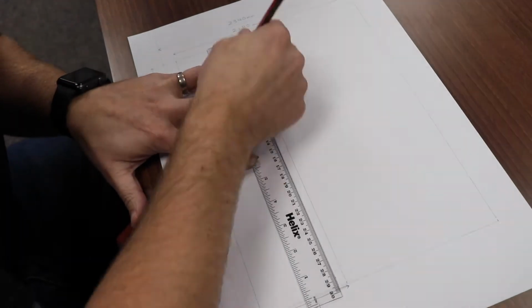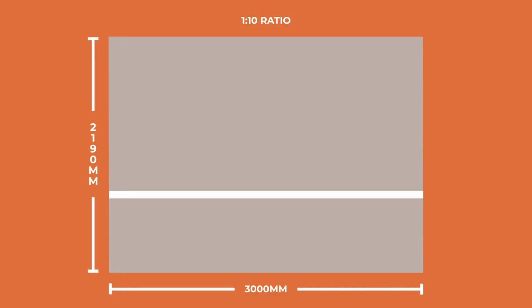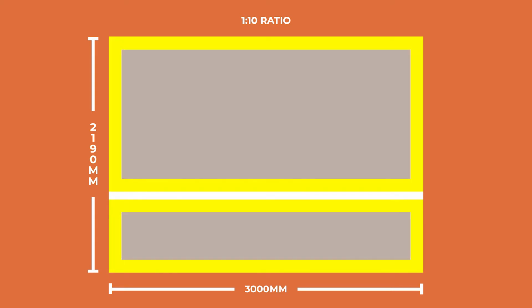Now that we've drawn our dado rail, we can start to draw our panels. We want the areas around our panels to be completely equal and parallel. We've decided to have this at 120mm because we think it will look good aesthetically, but there's no real method to it. To work out how to make the panels equal size with an equal gap, follow this method.